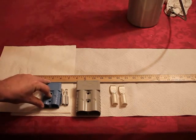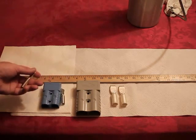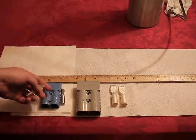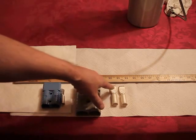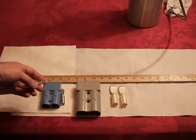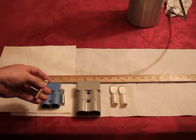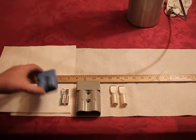I would say you might be able to get a 50 amp rating out of this cheap one. When I first looked at it and talked with some welding people we thought maybe a hundred amps, but because the contact surface is not ground flat like the good ones are, there's really no chance of getting even a hundred amps out of them — probably only about 50.